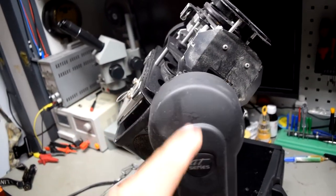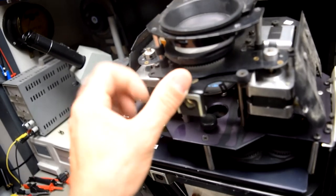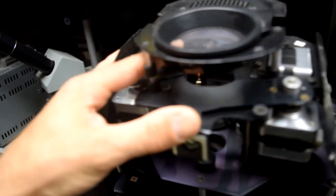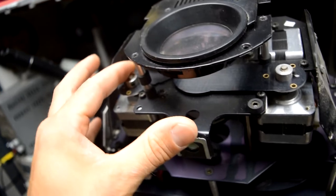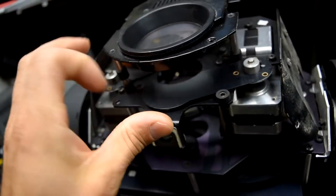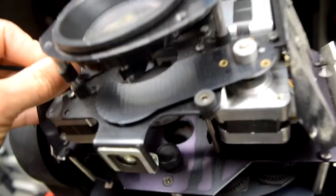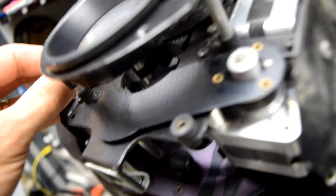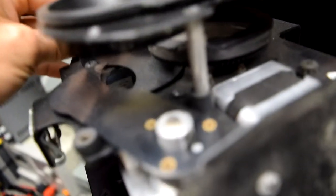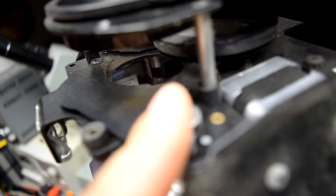Well, a little bit of offline job, but earlier I noticed that these shutter plates stay always closed. They would never open, and it was a dumb mistake. Now they are open, and they work just like they should, but it was stupid user error: the DMX configuration was wrong, so the shutter was closed all the time. So these are not malfunctioning.